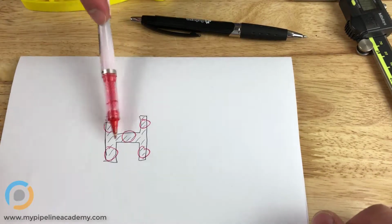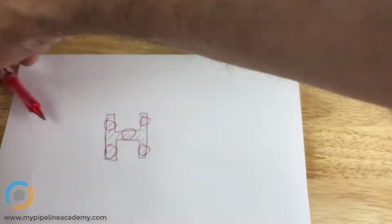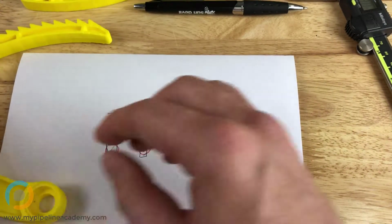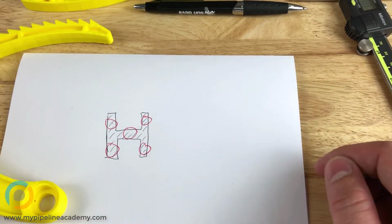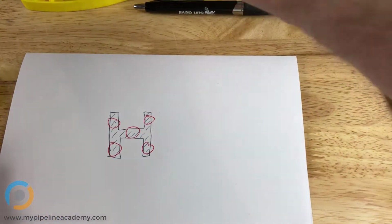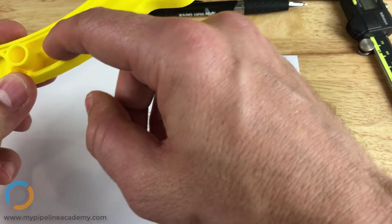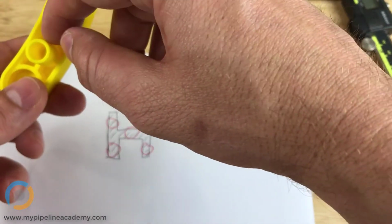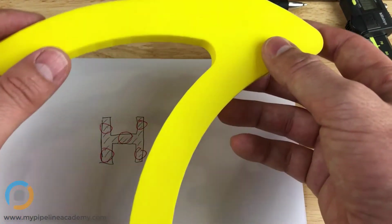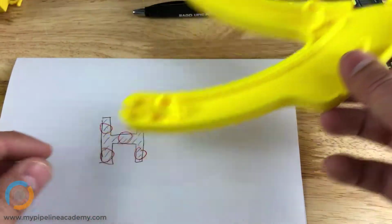And should these wall thicknesses be all the same thickness, or no? These ones would, yeah. For this part in particular, this is a pretty structural part. The reason that you use smaller wall thicknesses for ribs than you do for your nominal wall is because when you have a thick volume of material, you will often see what's called sink on the other side. Now this is 3D printed, and hopefully my ribs are well designed there so you can't really see it.